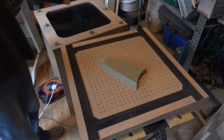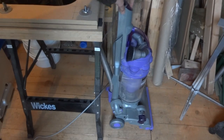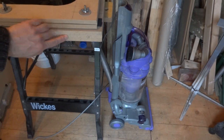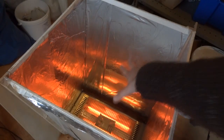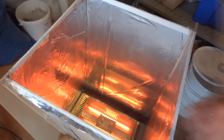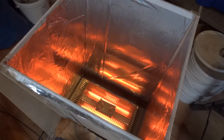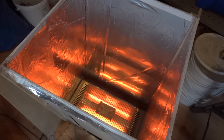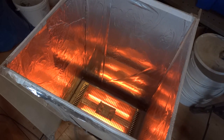I'm going to put the heater on, heat up the sheet of plastic, and then form it over the buck. I'm using a Dyson here with the hose connected to the bottom of the table. Yes, it's on a wooden floor in a wooden box, but it is a patio-stroke-workshop heater, so it would be no use if it set fire to everything around it. Heat comes out of the top, not the bottom. It's fairly warm — takes about three minutes to soften the plastic — and I've used it for years with no issues whatsoever.